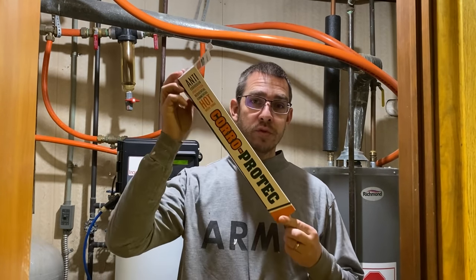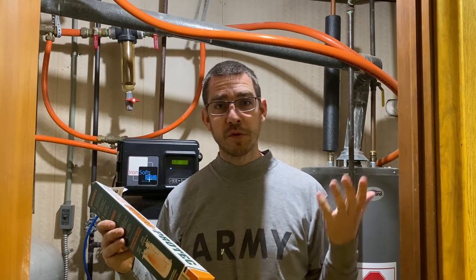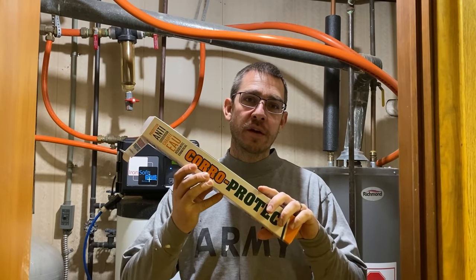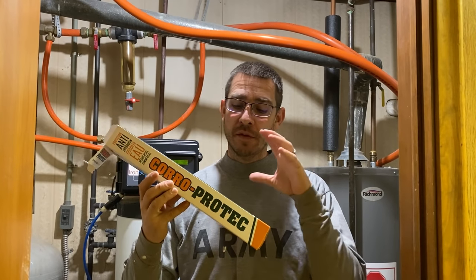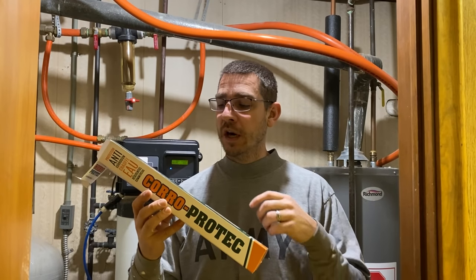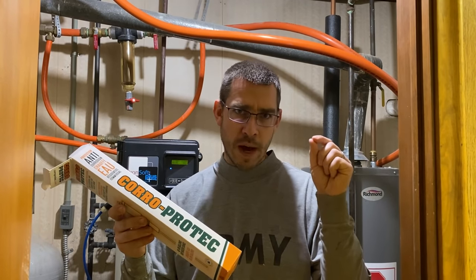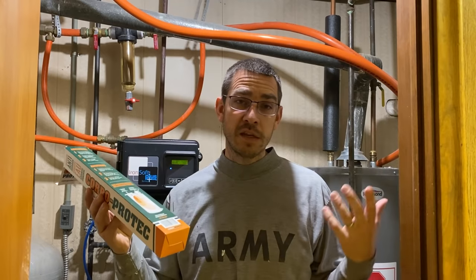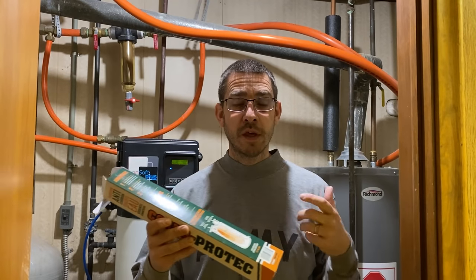This is the one that I am using. There will be a link to this in the description of the video, as well as a link to the previous video I did where I went through this very same process. So I'm going to do it on a different kind of water heater here, but same process. This anode rod serves the same purpose, which is to prevent corrosion of the inside of the water heater — the anode rod takes that corrosion instead of the hot water tank. It also gets rid of the rotten egg smell and it uses a small voltage, just a couple watts.